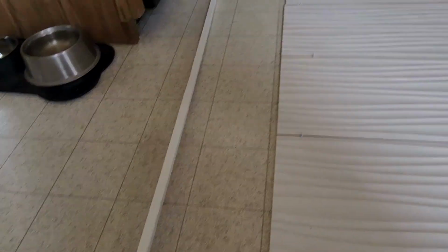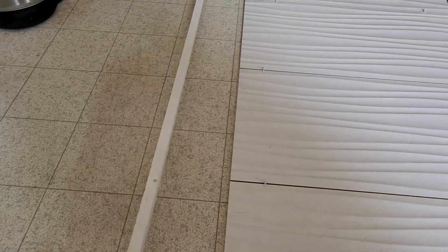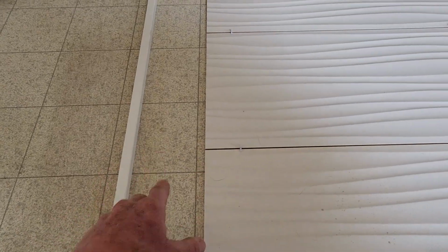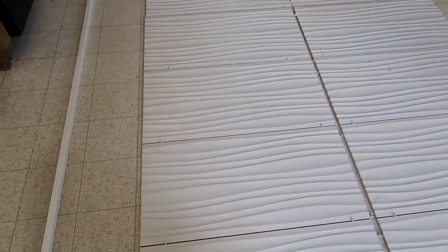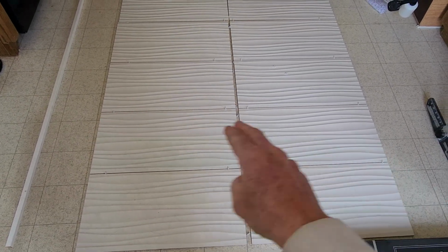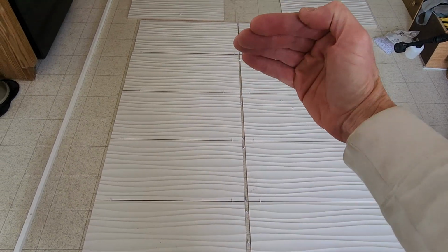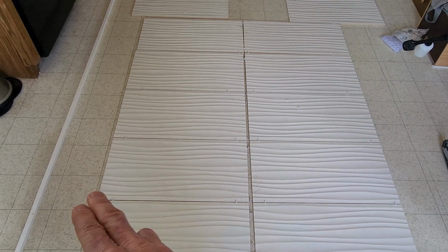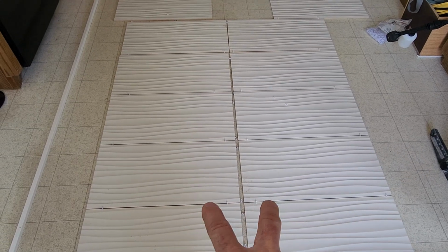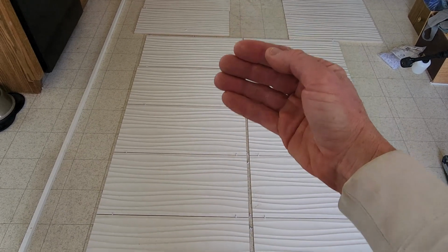And then if you want, I got this from the Tile Coach, Isaac's video. You can use a story pole if you want as well. That's perfectly cut to the height of my ceiling. And then you mark out your grout line so you're kind of working up. But what I'm going to do, and it's a great tip from his video, is I'm going to be starting with this set full row here, and we'll scribe in the bottom later on, but I don't want to be fighting the weight of the tiles coming down. So I'm going to be putting on, we'll show you that, a piece of wood with drywall nails nailed into the wall, and then I can stack 4 tiles on top of that wood so I'm not fighting the weight all the way to the ground.